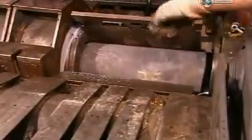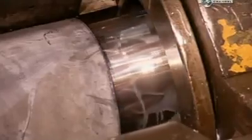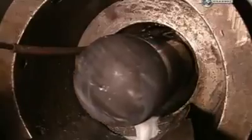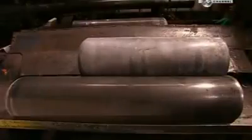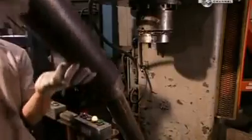After the disc comes through, steel jaws clamp down on the mandrel and the cylinder slips off. Now another press stretches it even more. This machine applies 250 tons of force to continue forming the walls of the cylinder. That liquid is a coolant to prevent overheating. The cylinder goes through as many as 3 presses, each one stretching it another 60%. This press forms the closed bottom end into a concave shape that reinforces the base.